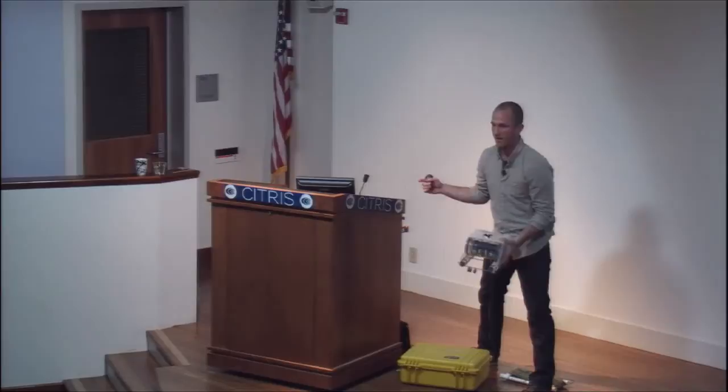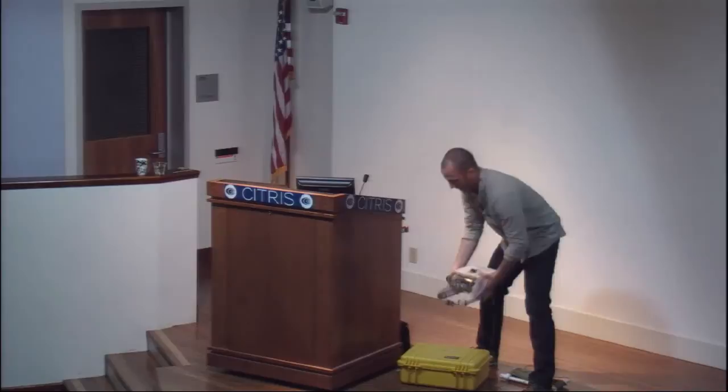You know what I always forget? To really explain what OpenROV does and is. It's got a camera right here and it drives around. It's got thrusters in the back and on the top, and it drives around and it sends live video through this very thin two-wire tether — twisted pair — back to your computer. And you're able to view it from there. The tether's length is a hundred meters, and that's been the depth limit so far.